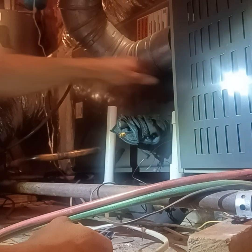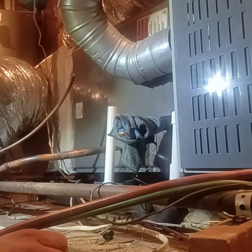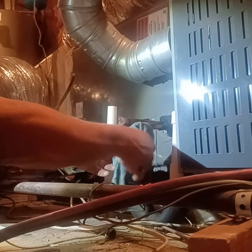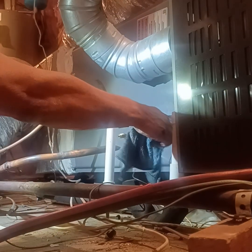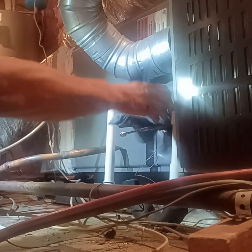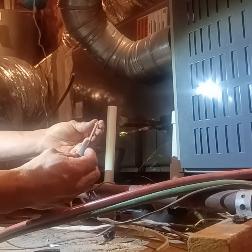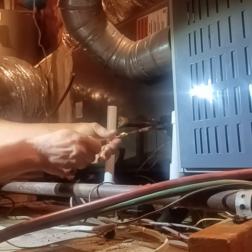Right now there is nothing in that coil, nothing, no Freon. It's empty. Cool it down. You don't want to melt your gasket. Got the gauges? Yes. Cool to the touch. Stick your valve stem in there. Get your little valve stem tool. I always snap it twice.